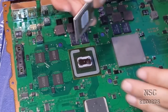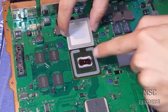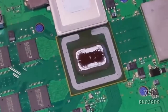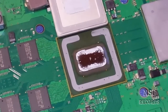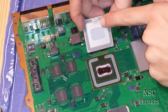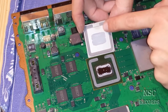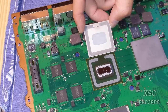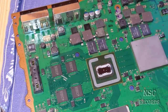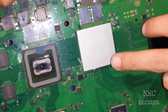This is now all cut live for you guys — and you can see again the thermal paste is really missing. Here you can see that the thermal compound is over the CPU. You can also see the color here — it was getting really hot here, and this thermal compound that is over here should be on the chip.